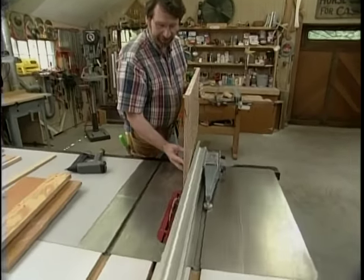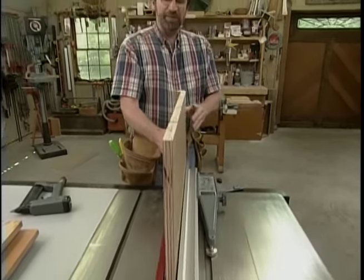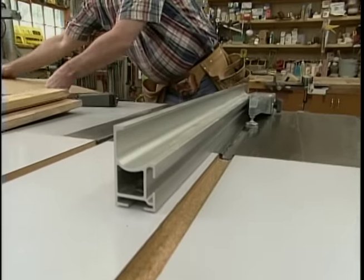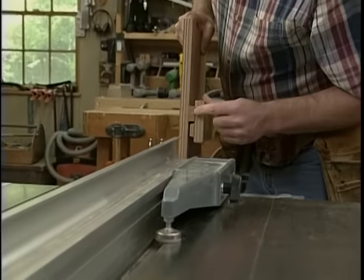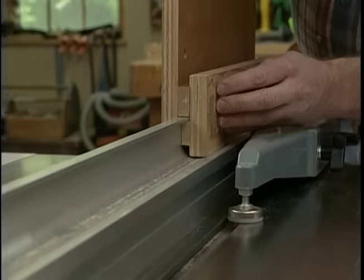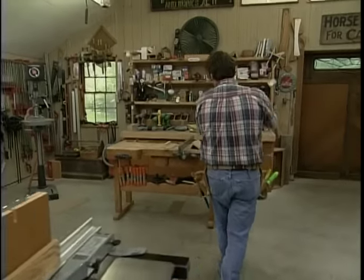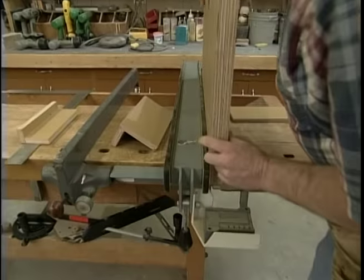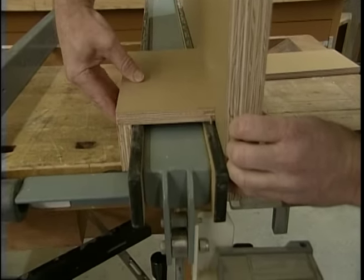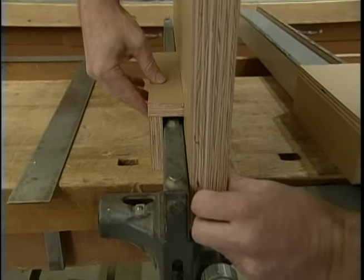The next challenge is to take this part of the jig and find a way to secure it to the fence so it remains vertical, yet slides along the fence easily. Each manufacturer will create a different situation to deal with. This is the unifence — it has a heavy aluminum extrusion. On the original that I built, I put a spacer equal to the top of the extrusion, a little filler that would squeeze against the thinner part, and finally another piece of three-quarter inch plywood, and that slides along the fence pretty nicely. Now if you happen to have a Biesemeyer fence, which has two flat sides, it gets a little bit simpler — just create a right-angle box that drops over the fence. If you have a standard issue fence, the idea is the same, except the box becomes a little bit smaller.